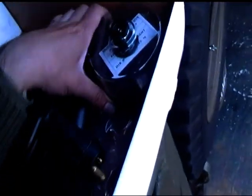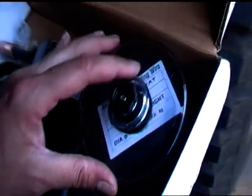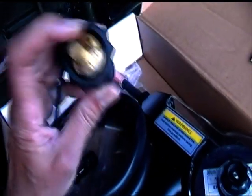Right, so to have a look at this little gadget, this is what you get inside the box. Yeah, it's a spool gun. It comes with a roll of aluminium wire, I think probably about 0.5 kilo, 0.8mm wire on it. It comes with a Euro fitting.